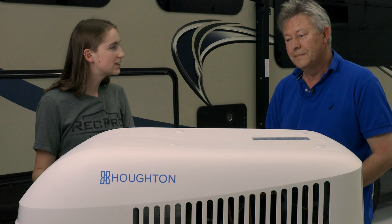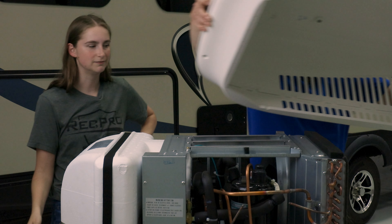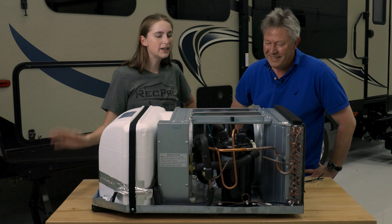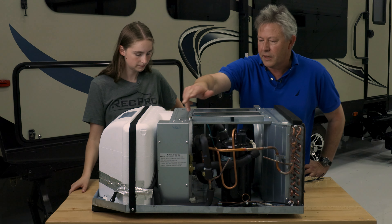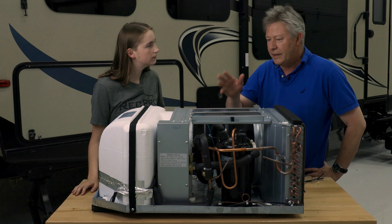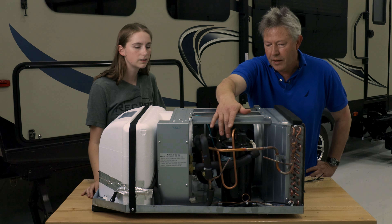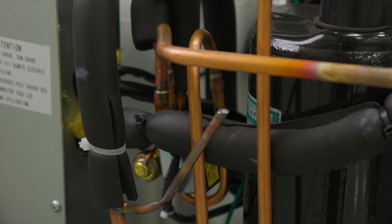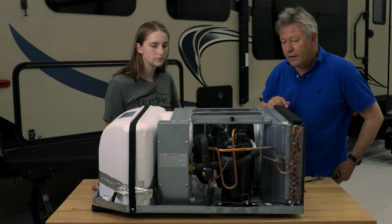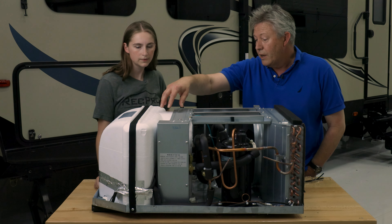So why don't we go ahead and take this cover off and look into the features on the inside. Inside this box we've got a microcontroller that takes care of all of the functions — all of the defrost, de-ice, timers, all that kind of thing. Next up here we've got a vertical compressor, and down here we've got the reversing valve, which is the device that allows it to operate both as a cooler and a heat pump. Finally over here we've got a very large generous condenser coil, and then under the polystyrene here we've got the evaporator coil and the inside fan.